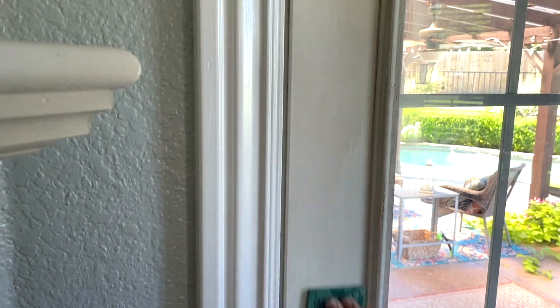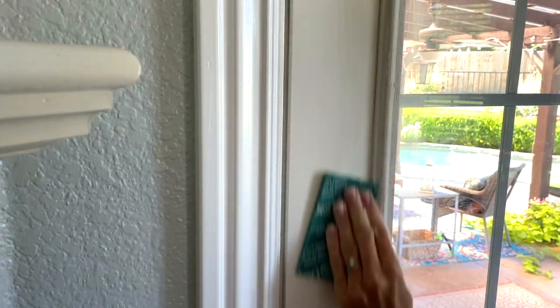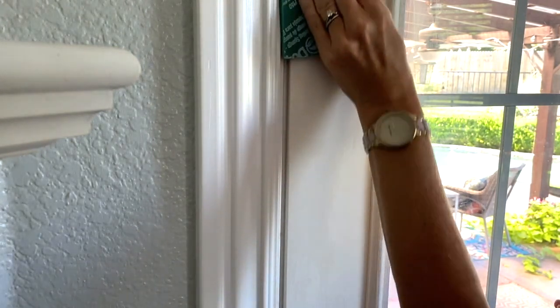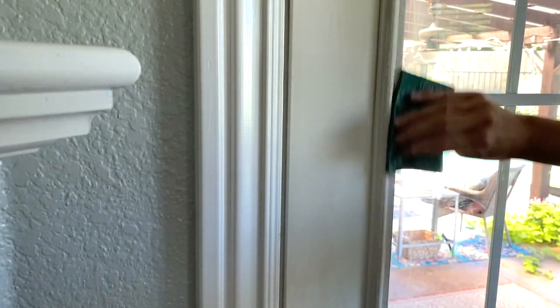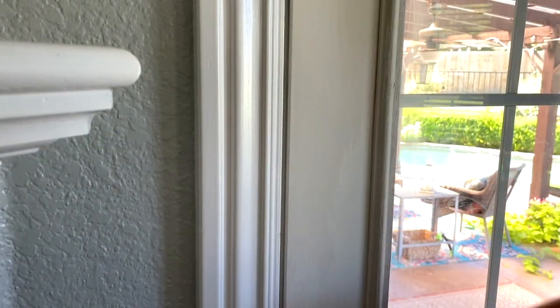So I spent definitely more time than I'd planned peeling off that paint. All the spots that were peeling, I scrubbed and peeled it off, and then the few places where the paint seemed to be okay, I cleaned it well and then sanded it smooth just to make sure that there was a nice smooth surface to start painting over.